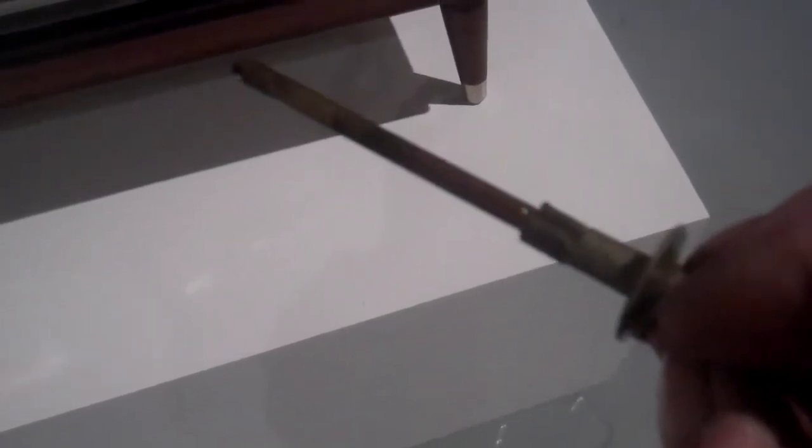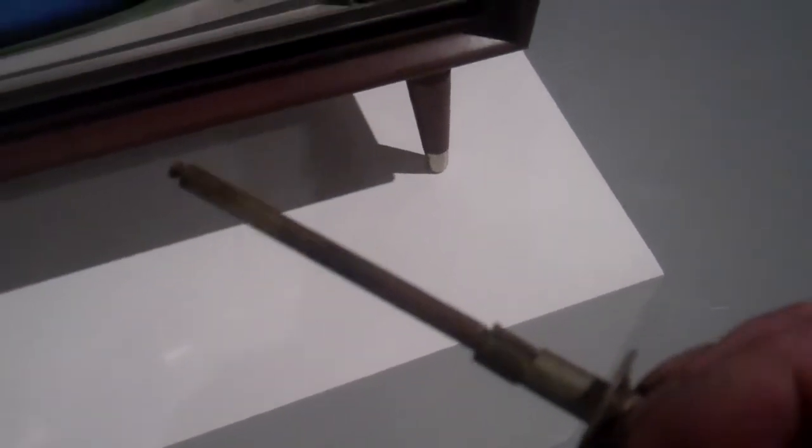The whole picture is shifting. I'm going to pull the chassis and take it outside. I brought my table, chair, propane soldering iron, and some filters. I'm trying to figure out which one is causing the problem and tack one across it. It's getting dim and you can hardly see it — about five minutes in it's just becoming visible. I want to pull the volume/power knob off and the whole shaft just pulled out — that's bad.